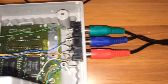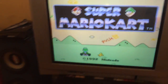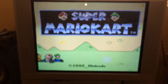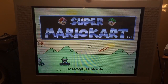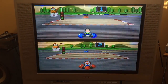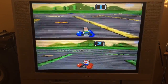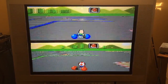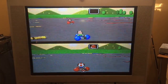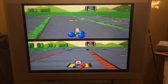Run that to your green — so this is a successful mod. You can see that the colors are all nice and neat. Everything's nice and crisp, looks nice. Can't believe it actually looks like this, but yeah, this is the S-ENC encoder chip success. All you had to do is tap pin seven on the AV out.